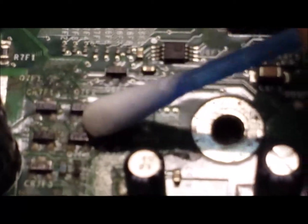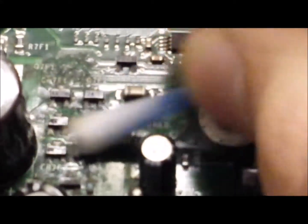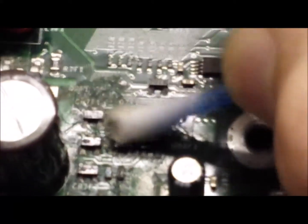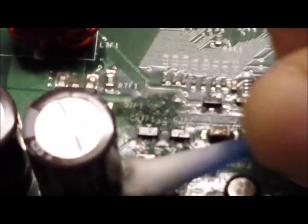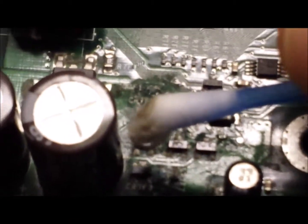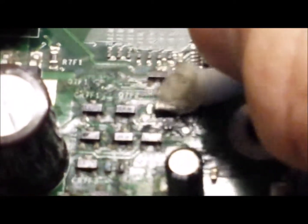While you are doing the isopropanol, do the clock caps as well. These are very dirty here, so just scrub them off. As you can see, they are filthy — it is probably stuff that has leaked out of the cap, which is why it is not keeping time now. I probably should remove the cap, because this stuff can corrode and kill your console. It is 15 years old, so we don't really want to be knocking them down or killing them off.